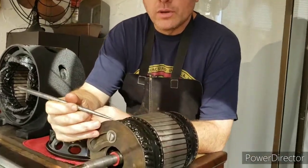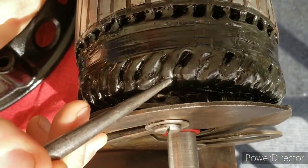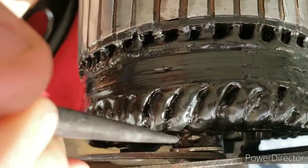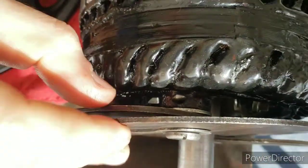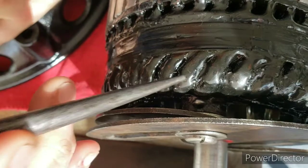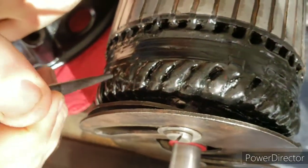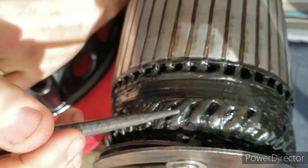The centrifugal switch here was so worn out that every time it opened and closed, it was hitting these windings, and the tops of these windings were all worn out and the wires were sticking out because there was so much slop in here. So I had to take this assembly apart — you can see I put that cotter pin in there — and I had to rebuild the linkages and put some new rods in there, some fatter spacers, and tighten up this mechanism because it had way too much play. Once I got that resolved, I had to deal with these windings. All the wires were exposed in here and that was causing short circuits. So I used two-part epoxy and went in between each one of these and put insulation in between them and got those all electronically sound. That took a while.